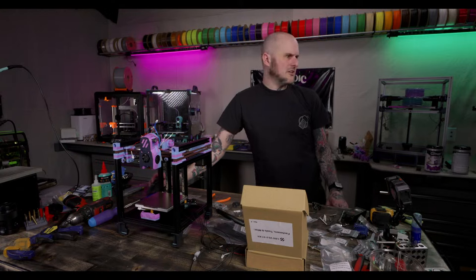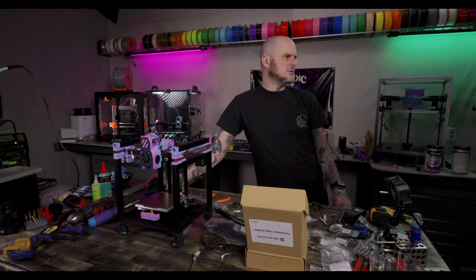Now it's time for the strain relief piece. 186. Let me look at the LDO instructions. Skip, follow the guide for the Pico Bilical. Okay. Pico Bilical, tool head mount. Oh yeah, those little spacers. Install metal standoffs, partly attach the PCB mount, then the PCB, then the spacer. Okay, that's pretty easy. And 3x12s. And M3x8s.